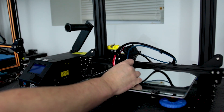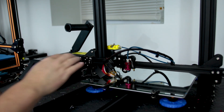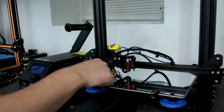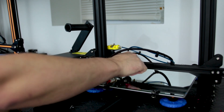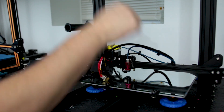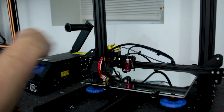I have a few options to resolve this issue, and the first one I'm going to show you is my go-to that I've been anticipating for some time: I'm going to swap out the entire unit with a replaceable quick-swap extruder hot end unit. It's basically the whole component — fan and all, everything, all in one, pre-wired, ready to go. All I have to do is unhook these, hook in the new one, plug it in, re-level everything, and it's going to be good to go.